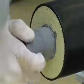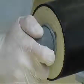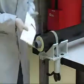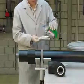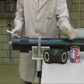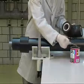Immediately join both parts completely without twisting and hold for a few seconds. Then wipe off the adhesive bead on the outside of the joint. Slip the shrink sleeve over the pipe to seal the joint later. Next, clean the other spigot of the double nipple as well as the socket of the CoolFit fitting with Tangit cleaner. Now apply a complete and even layer of cement in an axial direction to cover the entire socket of the fitting.